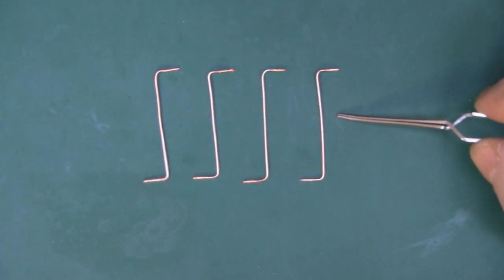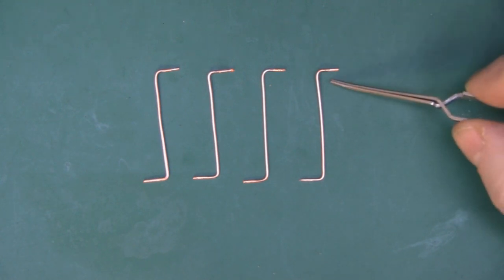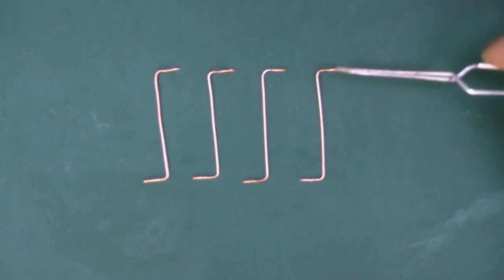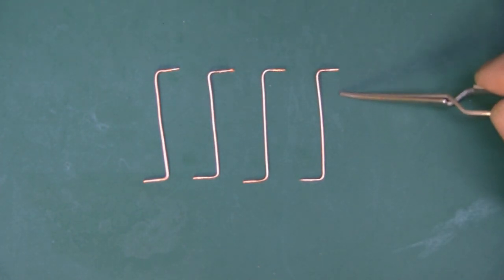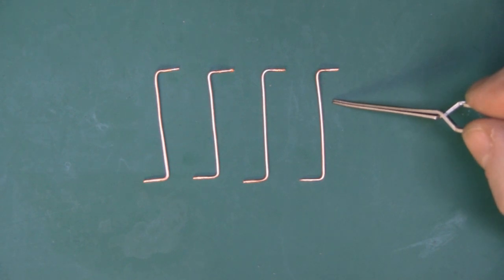This is all four elements ready to actually be bent and soldered into place. On the ends I've cleaned off the marker pen and I've also got a little bit of emery paper and just roughed them up a little bit on the ends, just so it makes it a little bit easier to actually solder.